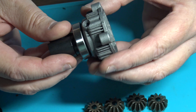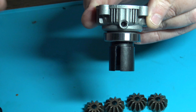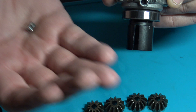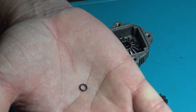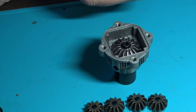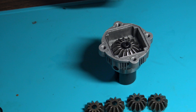Last thing we got to do is seal off that pin hole with this screw here. We're going to put a new rubber o-ring on that as well — make sure you put some Loctite on. I'm going to do the same thing now as far as assembly to the other end of the diff housing.